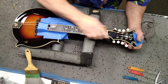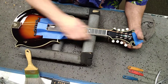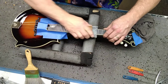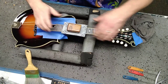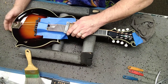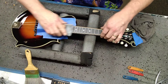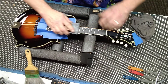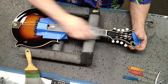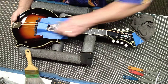Put this down and work it back and forth. I've rolled off the edge just a touch to get the bevels. This even gets these little tiny frets way down here. This is used paper with sanding pads — usually you only need to go down two or three times back and forth. This will give you perfectly crowned frets every time — it's very consistent.